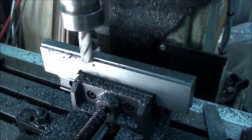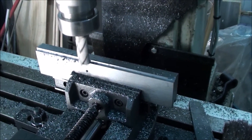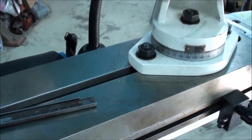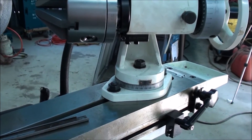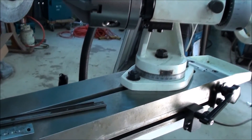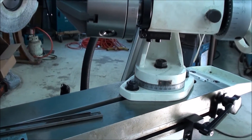So we're just machining a slot in the bottom side of it so that it can index on the table on the grinder. That'll index in this slot where we've currently got the drill bit sharpening head in it. It'll index in there and then we'll be able to pretty much use it, or at least the trials are set up on it anyway.